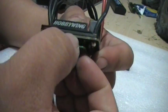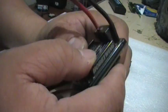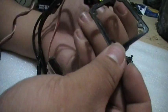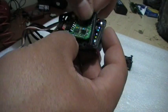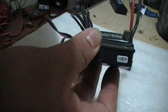As you can see, there is no gasket in there, so it's still seeping in here. It's just a little bit of extra precaution. They should have waterproofed the caps because they get water — sooner or later they're just gonna pop. Don't forget about this gasket that goes on the bottom: the groove side goes down against the case and the flat side goes against the circuit board. Make sure you get all your wires through there again, let it sit, grab the case, put it all back together, put the screws in, and you're all good. Hope this helps!